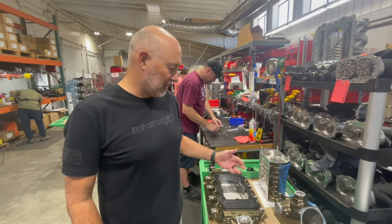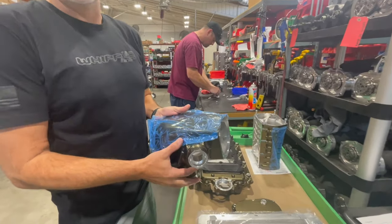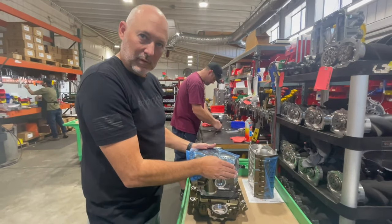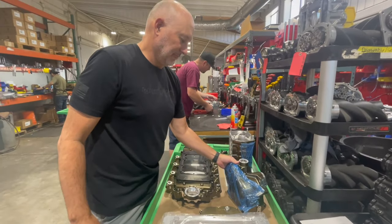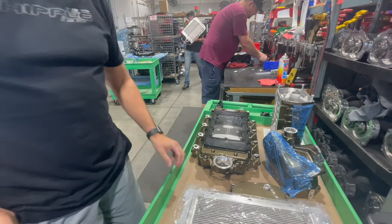We picked this because it really fits better, since it's got what we consider a driver side inlet. So it allows for a lot easier air ducting to the one side. And it's one of our more efficient superchargers, so the most amount of power out of your LS. Gen 5, 3-liter, intercooler.